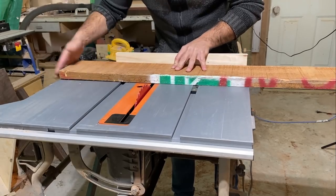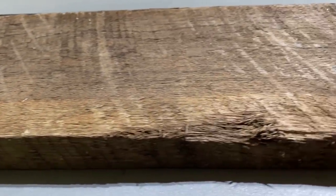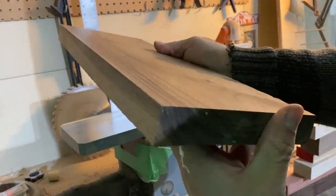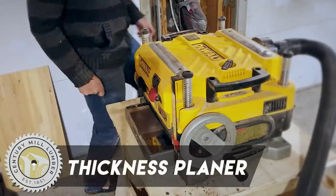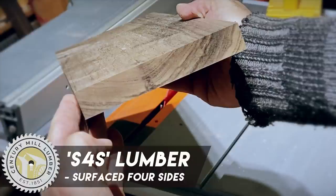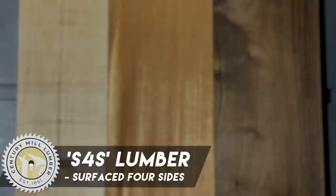I'm going to prepare this wood now for cutting pixels, cross-cutting my stock down to a manageable size first. But we're not quite ready to cut pixels yet. The lumber you buy at hardwood dealers is usually rough sawn — it's also not often very flat. This machine's called a jointer. Its blade is aligned with a flat table, and you can mill one flat face of your lumber this way. Put the flat face up against the jointer's fence and you get a nice 90 degree angle from edge to face. I'll now feed that original flat face into a thickness planer. Its flatbed registers the bottom face and replicates it on the top face. The fourth side is simply cut square at the table saw. The result is what's called S4S, or surfaced four sides. Your lumberyard can do it for you, if you ask nicely.